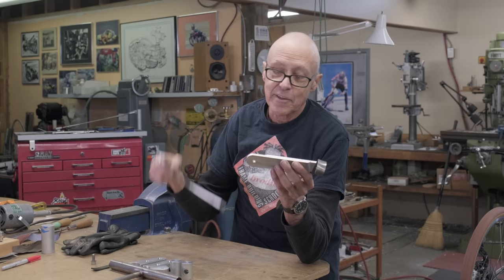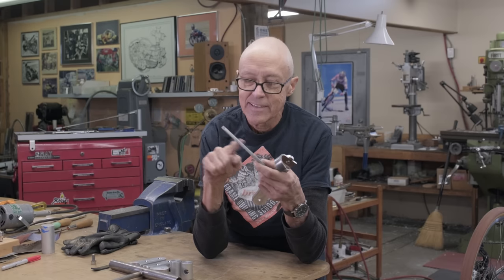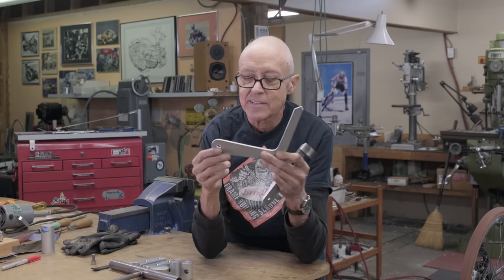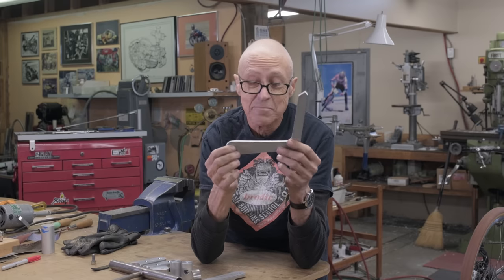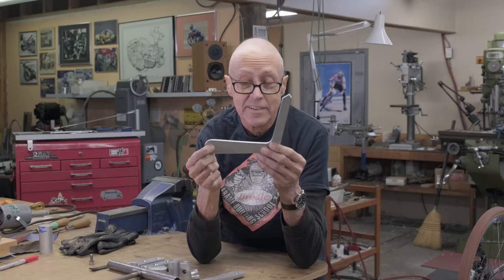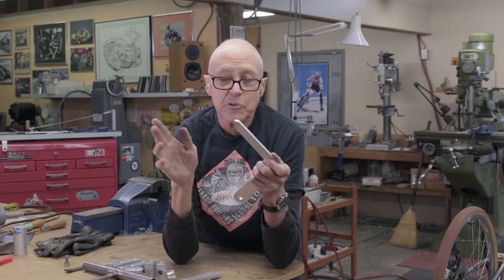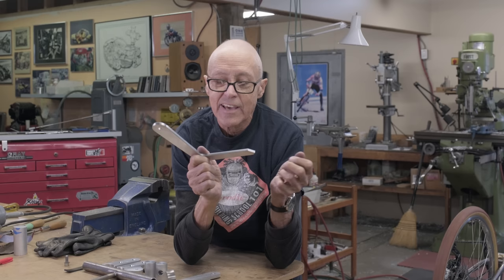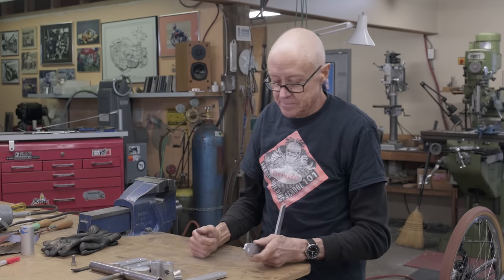Hi, I'm Paul Brody — we're back. Yesterday we were filming, and after Mitch left I decided I was really quite unhappy with this arm and the hook. So I sent a text to Mitch and asked him to please come back. We're going to make a new arm — I wasn't happy with the two-piece and the shape. This one is going to get bent. This is 6061 T6 aluminum — the T6 means it's tempered, that's the hardest you can make 6061. I'm going to take this part to T0. When you heat it up and let it cool, it takes out the tempering. This has to be moved over 5 eighths of an inch, so let's do that. I'm using the soft jaws.